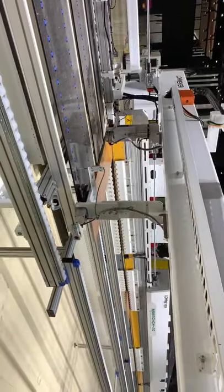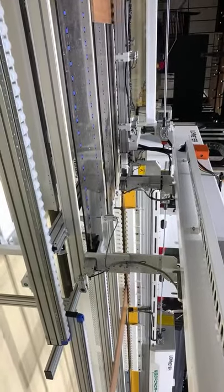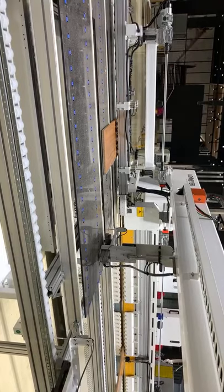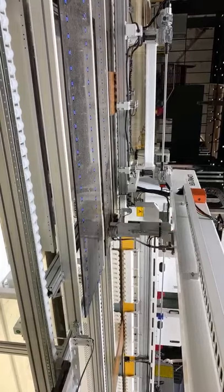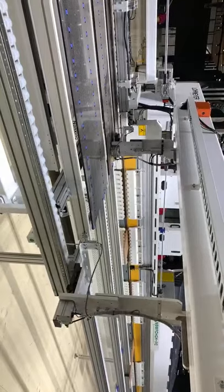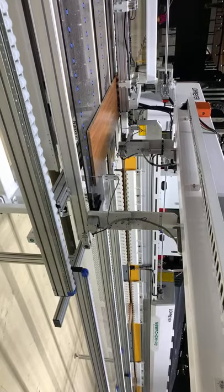In the camera view now is the pusher system — the flexible pusher system. Its function is to do the side alignment. We can see two groups of units: one is on the inner side, the other is on the outside. After the measurement device captures the information, it is sent to the flexible side alignment system. The side alignment system will then move to the right position to stand by and wait for the workpiece.